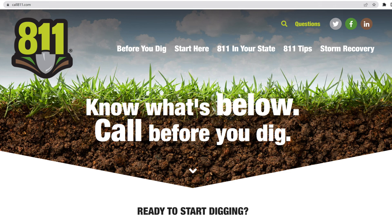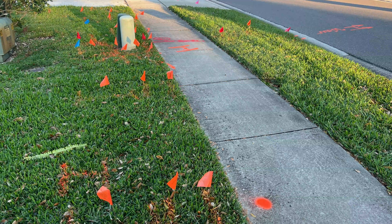Don't do it without calling and having somebody come out and provide locations for all the utilities in the ground so that you can safely put your ground rod in an area where there are zero utilities at risk. Just last month there was some work done on the backside of our block, and this is what it looks like when they come out and mark where all the utilities are located so you can safely do the work you have planned.